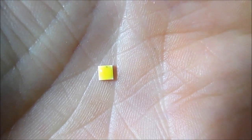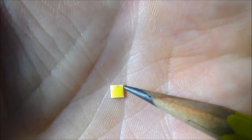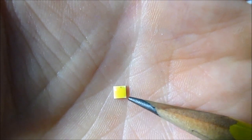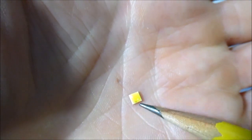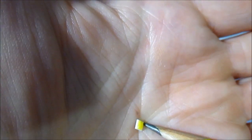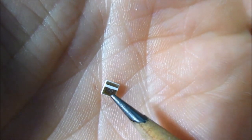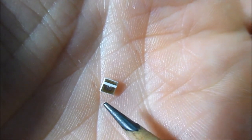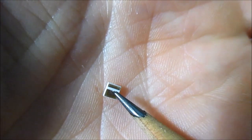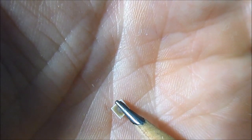Here is a close up of it. You see that little dot? That's a protection diode — it helps protect these from static electricity, since all white LEDs are static sensitive. Here is the bottom side; you can see the contact area, with the larger contact being for heat sinking. It is a high powered LED for its size and needs to get rid of that heat.